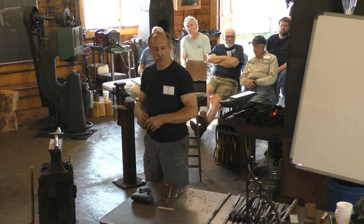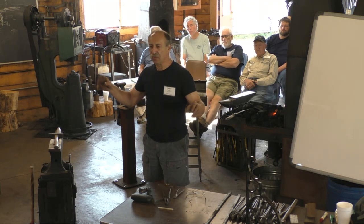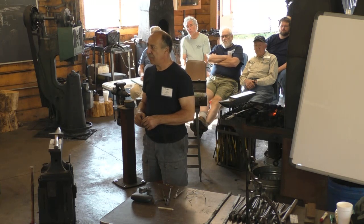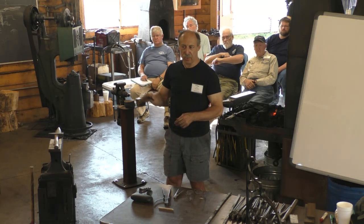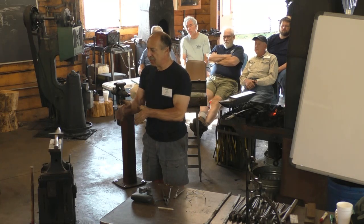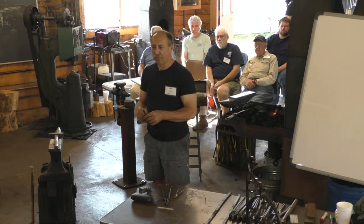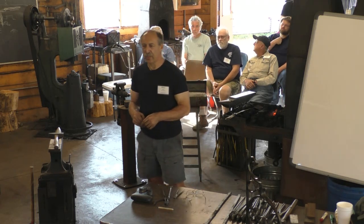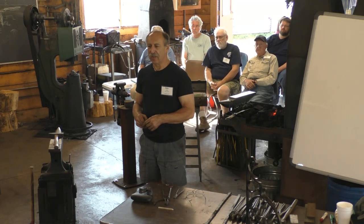And so that was sold just as is. That was called blister steel because it actually raised blisters on the surface of the bar. And it's the most uneven. The surface of the bar generally has more carbon than the core. So any section of that bar is going to be uneven throughout its cross section, and maybe uneven along its length as well. Would it penetrate all the way to the center? To some degree, yeah.